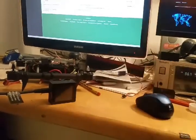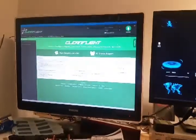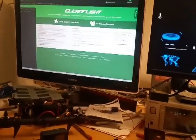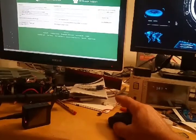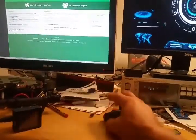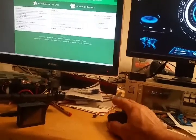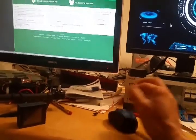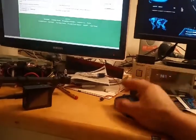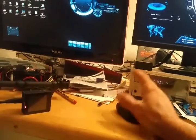What you want to do is connect to it, plug it in — it's going to say the thing about updating firmware and all that — and then it's going to take you to the CLI. Personally I don't like CLI, I like the graphic interface, but the CLI has its nice stuff. When you go into the CLI, first thing you want to do in Clean Flight is type 'dump'. When you hit dump and enter, it's going to throw a huge long list of stuff out there, and you highlight everything up to the first pound sign — which is 'pound version'. You highlight and copy it, then put it on your desktop in a new file, just in case you lose it. That's what it looks like — you highlight every bit of this.